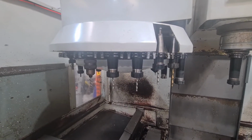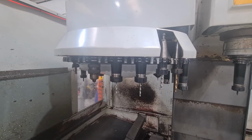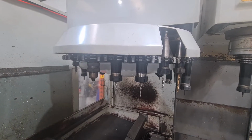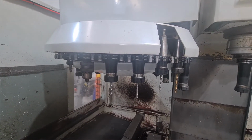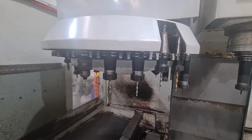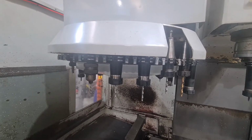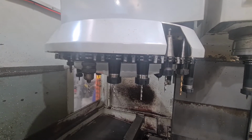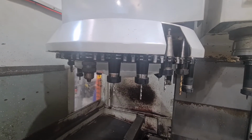Anyway, you can buy DC braking units, but they're quite expensive, like a couple of hundred pounds. So I had a look on the internet, and it was quite easy in the end. I just used a timer relay, a couple of relays actually. Basically you turn the AC power off, then you inject some DC power into the windings. That brakes the motor. We had to play around with the timings, but it turns out 2 seconds stops it in exactly the right point. We just injected 24 volts DC into the windings for 2 seconds. It stopped exactly at the point where we wanted it.